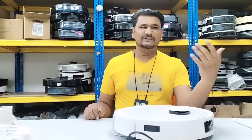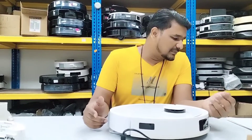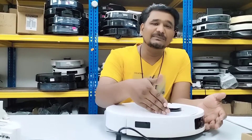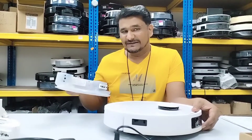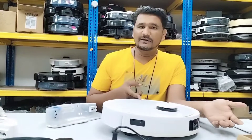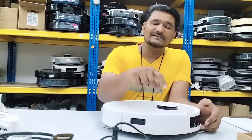If the light is white, it just means the depot is ready to use — nothing is wrong in that normal case. But the customer mentioned that they are using the Osmo Pro tank and the light stayed white; it should be blue. So that is why the customer sent it in for repair. There is only one likely reason — the connector. We will replace the connector and after that it will be okay. Once we attach the Osmo Pro tank, the light becomes blue.